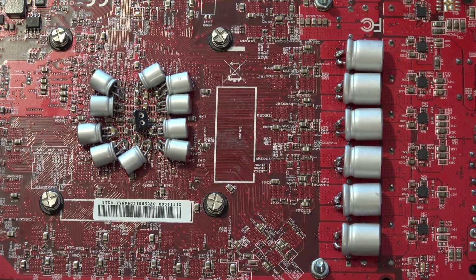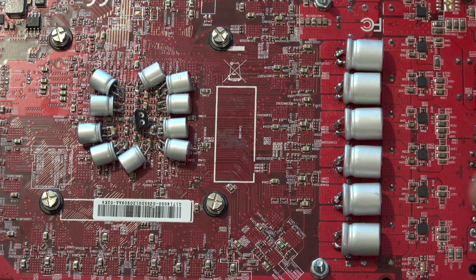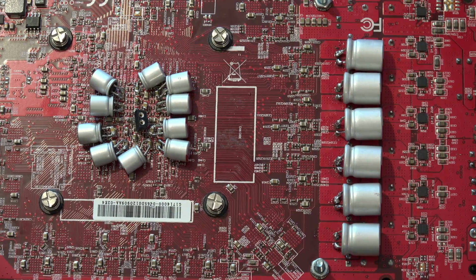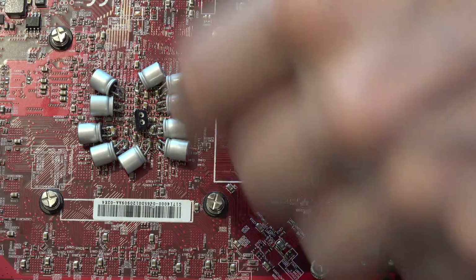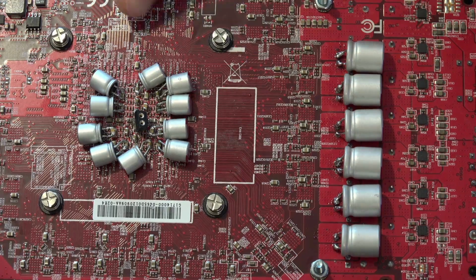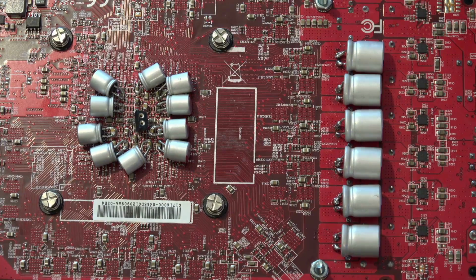on the classifieds. They'll often have the three-phase memory power, which is like a mile away from the actual memory chips themselves. They'll often put the entire output filter on the memory chips and not anywhere near the memory VRM proper. So maybe I might be right about it. It might just be best to put all of your capacitance by the actual load and screw the VRM.